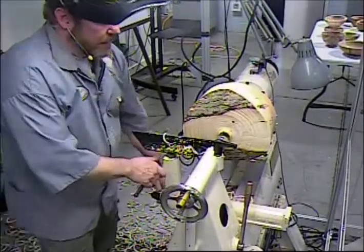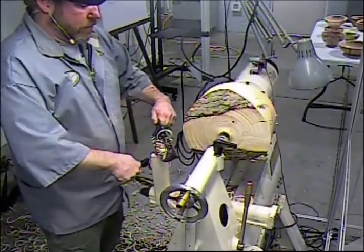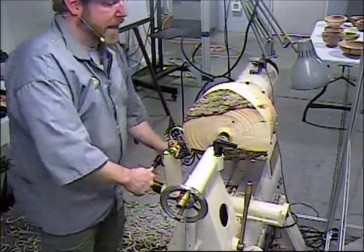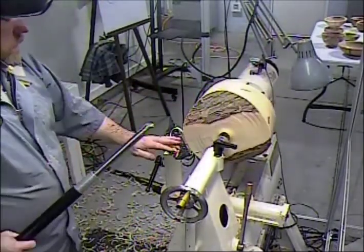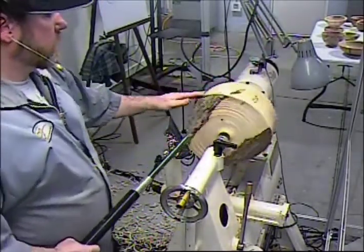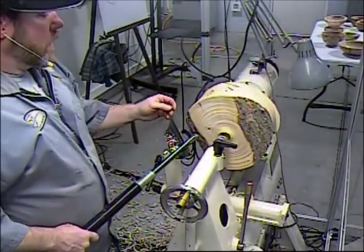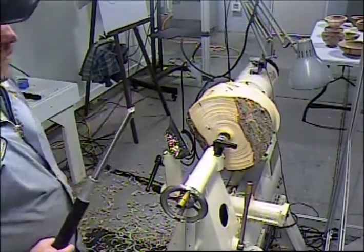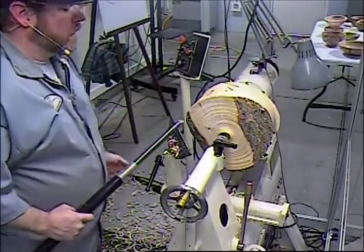All right, the third and last part of this roughing out, to round it out, we're going back to the push cut, and we want to just hack off this corner. So to do that, we're looking for something around 40, 45 degrees or so. And coincidentally, we're ground at 40 degrees. So this is where the push cut really is going to come into play.